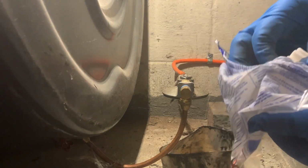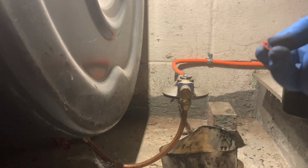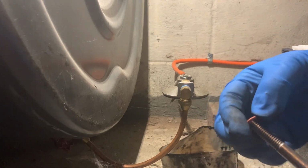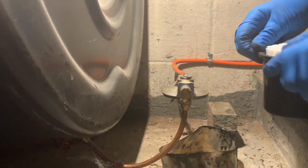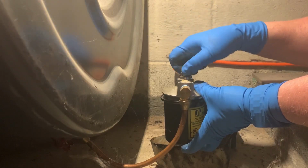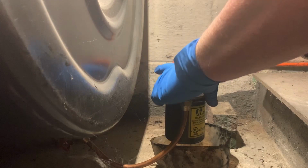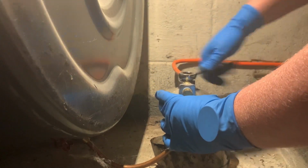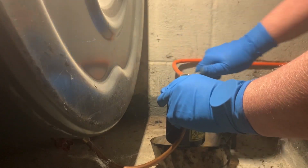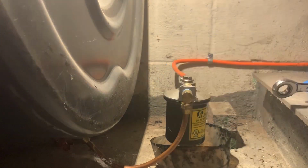I've got a new bag here, new filter. Pop the new filter in, new gasket up top, and in this little bag, this bag here's got this gasket. This is important. This gasket goes over top of this bolt. You put that in. Make sure this gasket's seated in there good. Put this back in, start it. Now make sure that that's kind of centered, and you tighten him up. Make sure it's nice and snug. We don't want no leaks.